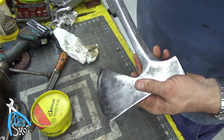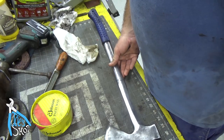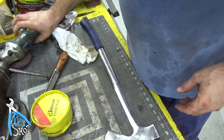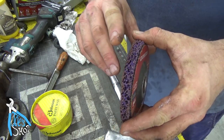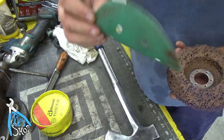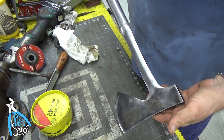This will dry and provide a nice layer of protection, like for a workbench or table saw tabletop. That came out pretty nice. So there we have it - this is not a restoration or anything, it's more maintenance. You can see that regular hand soap does a pretty good job of cleaning the handle up, and then with just a couple minutes of work with the sander - whatever type of sander you want to use - you can get the job done. I would say that abrasive sanding, like a flap disc on your angle grinder, would be preferable to a wire wheel in this particular instance. There are other options like paint stripping discs, but these are cost prohibitive in my opinion - while they work fast, for me it's not worth eating a five or eight dollar wheel as opposed to a three-cent piece of sandpaper. I very rarely use those. Anyway, I think this turned out all right - not too cerebral, but just wanted to show you how I go about cleaning this up. Thanks for watching, thanks for subscribing, and I hope you're having a good day.